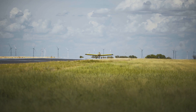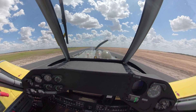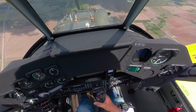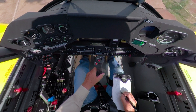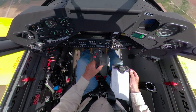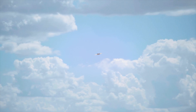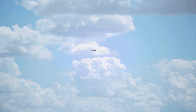Now the airplane is flight tested. Engine data is recorded on the ground, during takeoff, during a climb, and in cruise flight. Instruments and flight controls are all checked and adjusted for proper function. The airplane's trim is evaluated and adjustments are made to produce a hands-off airplane in cruise flight. Various airplane handling qualities and flight characteristics are evaluated as part of the flight test.